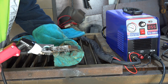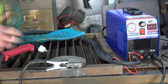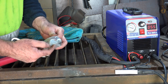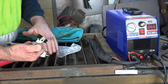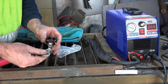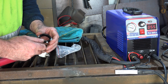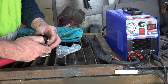The advantage of this machine is the nice heavy torch. This machine also comes with a guide for the torch — a couple of little wheels, a standoff guide designed to keep your torch head off the metal you're cutting. I like to do it freehand because I've had a few years' experience, but if you're not too confident freehand you can use these wheels. We'll put it on and see if it actually works — it's designed to help you do shapes and that sort of thing.